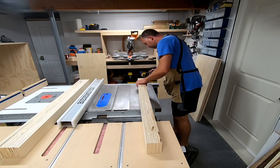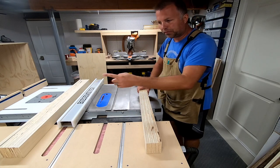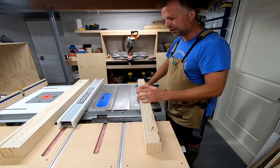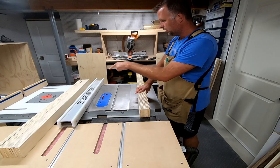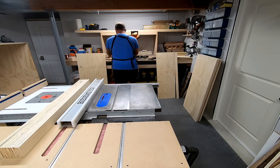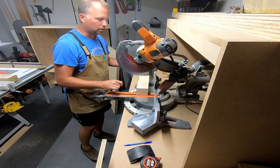I'm going to line these up, clamp them, and cut them all to the same length so I can cut off the rough end. The side pieces — the longer ones — I'm cutting to 47 inches. The way I want to make my board, it's not going to be flush all the way around; I'm going to inset a half inch in all directions, so the actual top overlays about half an inch all the way around — like the professional boards. That looks a little cleaner. I've got enough here for two boards, so I'm cutting four of each. The extra pieces will be for the legs and cup holder sections.